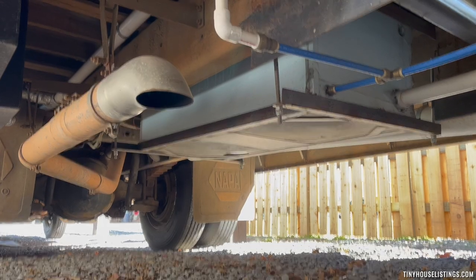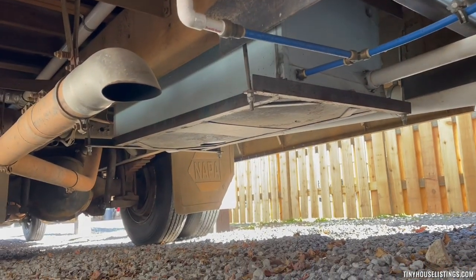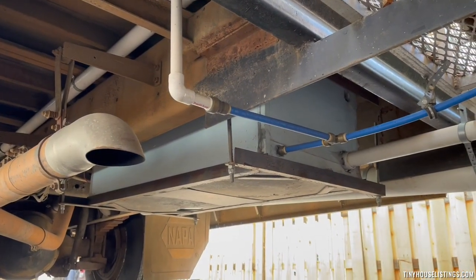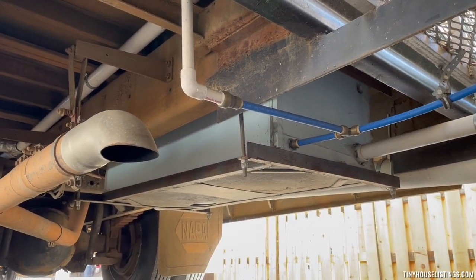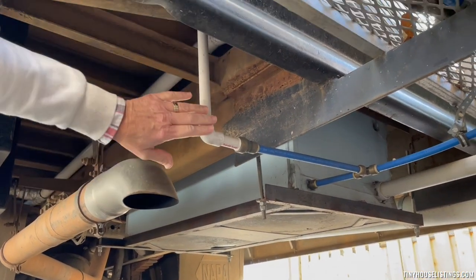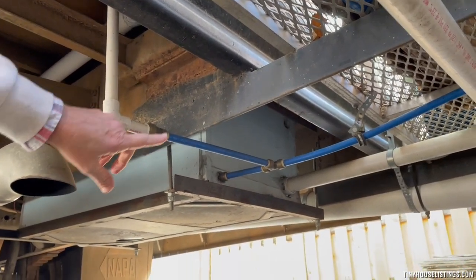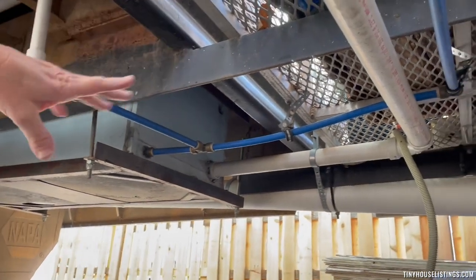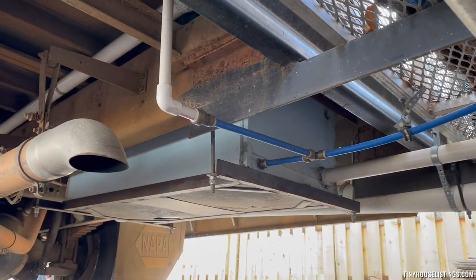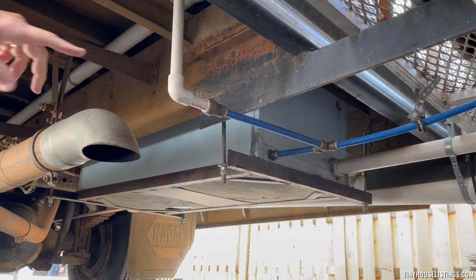If you look underneath, you see that Sarah's dad had welded a rack, and we had lifted where the gray water tank would go. We used the PEX pipe plumbing mainly for inside, as well as to drain the water out. However, when we first used it, it wasn't big enough. So it came back and we added the bigger PVC pipe, and that's what we used to hook up and drain everything. So that's why you'll see an extra little spigot. Like I said, we ended up trying to figure out how to make this work.